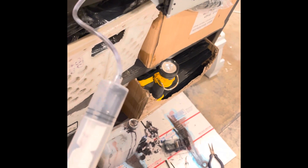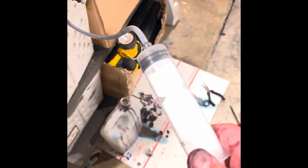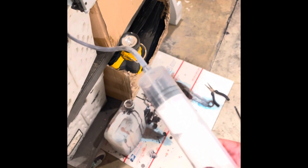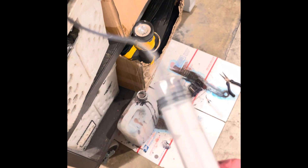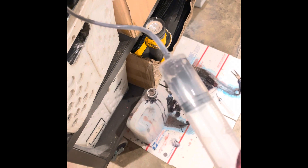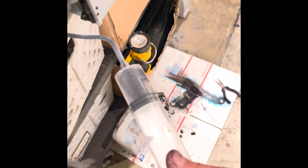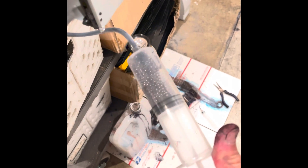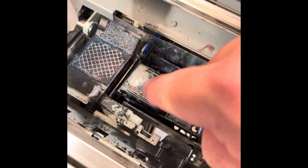You can see my head is in a park position right now, and you can do a pull to pull ink out. If you pull on this you'll feel some resistance and it'll pull ink through the head. The way you can tell if it's actually pulling is it'll pull back, and if you want to take a quick look you can move the head and you will see ink being pulled through.